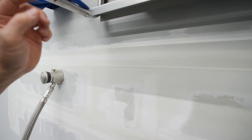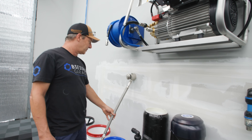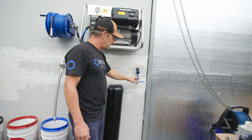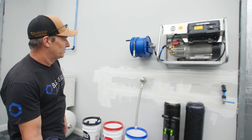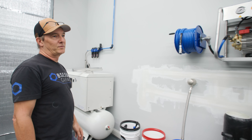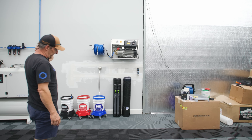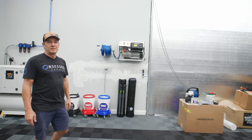Probably 14-15 hours total between this and next door cutting the wall apart — some of that is finding parts and going next door for things. That's about average on a custom install. Everyone's custom, right — it depends on what you have to deal with. We had plywood here, no studs, so it took a little more time to put bolts and double-nut it and get this thing hung. I put the jumper hose on — this is our three-foot OG spec jumper hose — with an anti-vibration clamp. I think we can get water going today and get it running, then play with the DI.